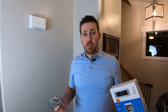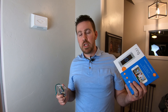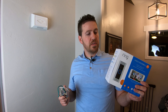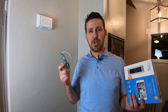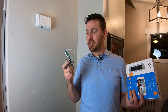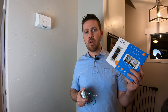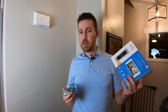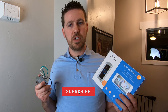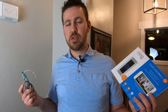We've got power now. It was pretty quick and easy to upgrade this transformer. We had the same low voltage issue with both our Ring and Eufy video doorbells — most of these require a 16 to 24 volt transformer. For about 20 bucks on Amazon, we were able to get a new one and now it'll power all our video doorbells. We do a lot of reviews and wanted a solid transformer to test them all. If you have any comments or questions, leave them below, and if you haven't already, please subscribe to our channel — that's it from Trinity Families, see you next time!